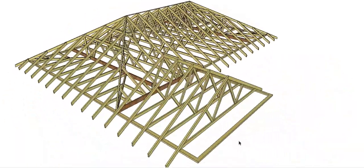Now we need to go around to this side — common trusses. This is going to be a gable end. The way I would put these common trusses up — this girder was already here — I would put up this last truss first, temporarily brace that, then I could get a string line and run those trusses nice and straight. I would temporarily brace them, and in this case I've run my speed brace right back to my hip because I'm going to have a line of saddles in there anyway. I've run it out past my wall because I'm going to have a verge truss out here when I finish.